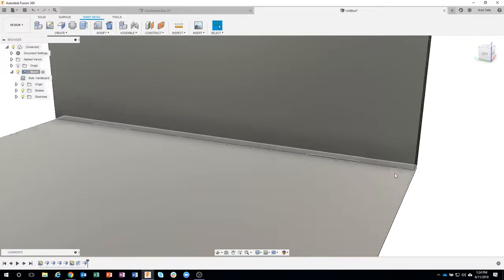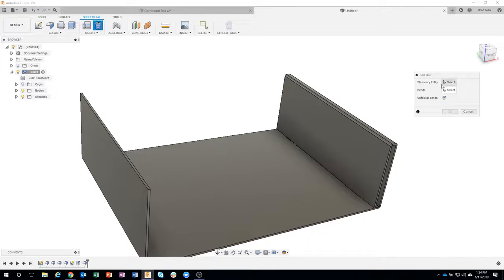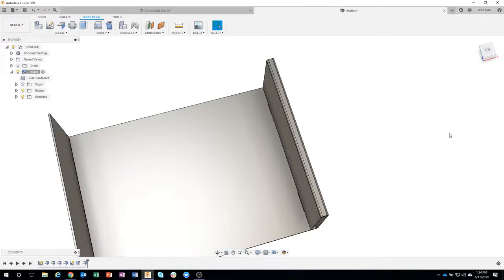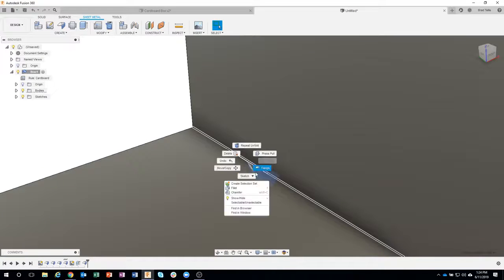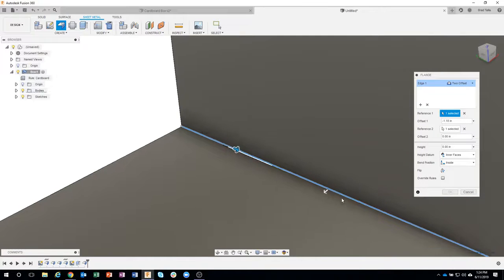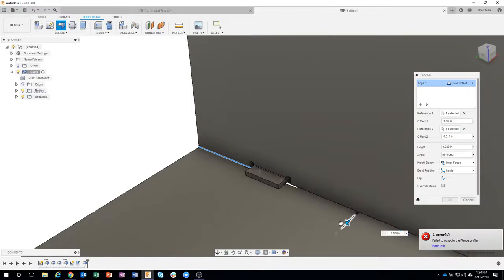Let's go ahead and unfold this really quick just to see what that looks like. I'll say unfold all the bends, and let's just click on that, and we can see we've got a little rectangle and we've got this nice little tab that's gonna tuck down into that rectangle to kind of hold it together. So I'm gonna do the exact same thing on this other tab. So I'll come in here and say flange, and I'll do the 2 offset. Again, I just kind of sort of get close just to give me a visual of what that's gonna look like. I'll start to drag a little bit.